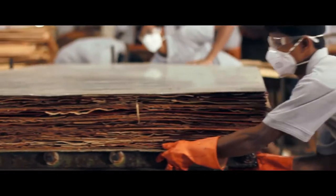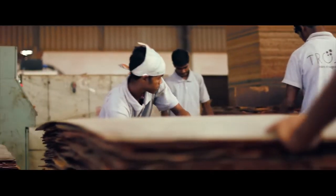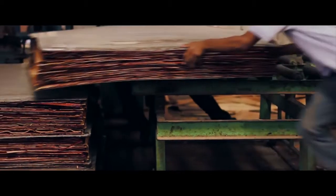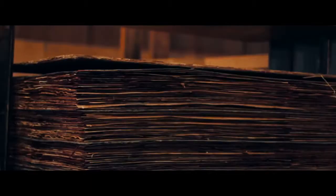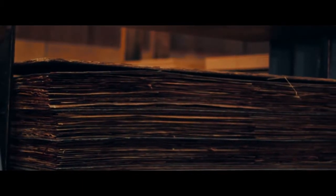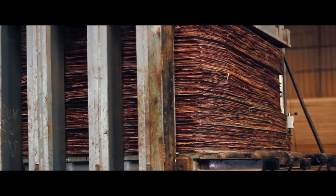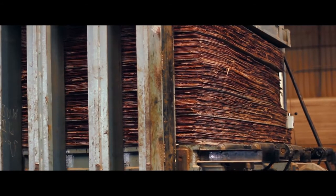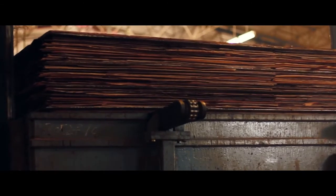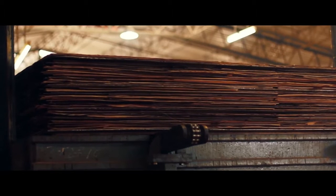These stacks of veneer and core veneers that are piled in groups then go into what is called the pre-press. This is a process unique to the brand. It ensures that the applied resin penetrates into each and every pore of the veneer. On applying further pressure to required boards of plywood, the glue solidifies a bit to form a semi-bonded plywood. This is important to ensure greater penetration of resin and stronger bonding of the plywood.